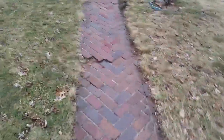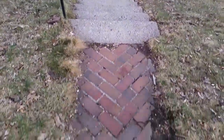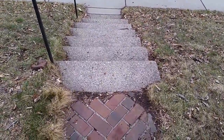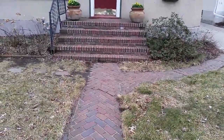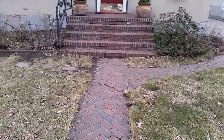The walkway is three feet wide. It looks like it might be sitting on concrete — this brick — because it has been tuck pointed, but it is certainly moving. Keep in mind that the sidewalk is three feet, but these steps here are four feet and we will just be flaring the sidewalk to the steps here, and flaring the sidewalk to the outside of the steps — to the inside of the buttress, but to the outside of the steps.